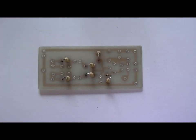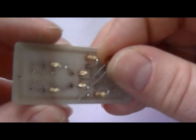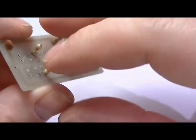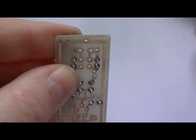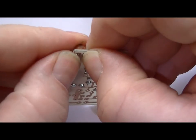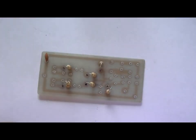Okay, next job is to solder in the 9 caps. What I'm going to do is start with the ceramic caps. I'm going to start with C1, which is a 1N. It doesn't take very long to do these. I could put one of these together in 10 minutes. If you're just starting out, like a lot of my subscribers are, there's no rush. It'll take you half an hour to an hour, a lot.